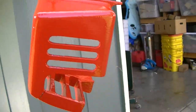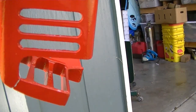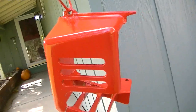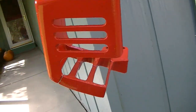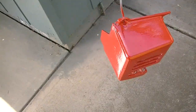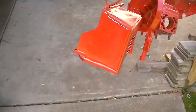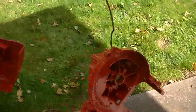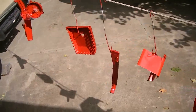These muffler guards look like a sand cast to me, so they have a little rougher surface, which is good — it's harder to get paint to run. But it's also harder to get good coverage, so that's one of the parts where three coats is a good idea. So anyway, that's the base coat. I'll let this dry for about a week before doing anything else.